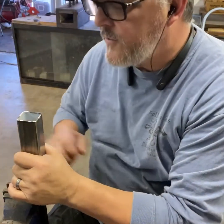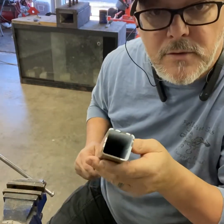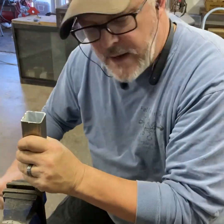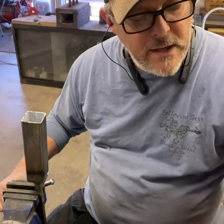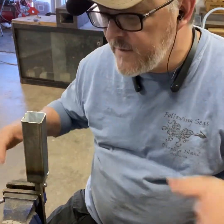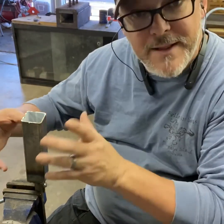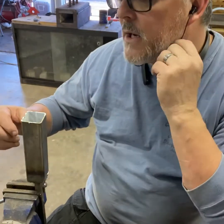It's been about 30 minutes or so since I put the whiteout in the can. It is dry now. So now we're going to fill it up, and then we're going to alternate our 1084 with nickel and our 52100 ball bearings. Fill it up, tap it down. I'm trying not to over tap it. Maybe that's what I did, made it settle wrong. I don't know. I'm still learning on this.